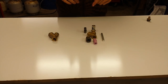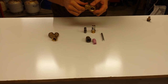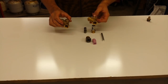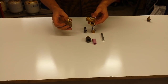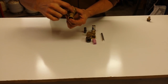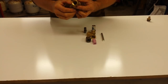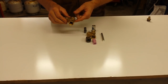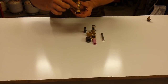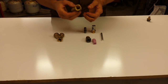The first thing I'm going to cover is the actual body. There are two types that I've been watching for these builds. This one here is a more reputable design - you can tell it's much heavier, built better, got better casting. But the problem with it is there's a divot in here that forces water up into the strainer before it comes back out, making sure it goes through the strainer basket to collect debris. We're not using the strainer in this, so that doesn't matter, but that deviation means you can't get as good a straight-through flow, which is what we're after.